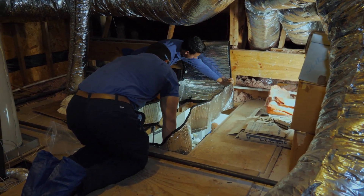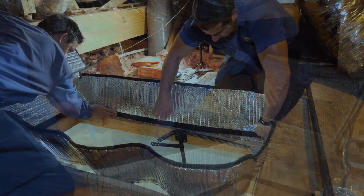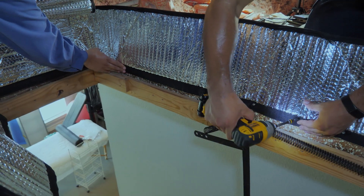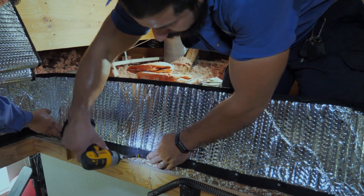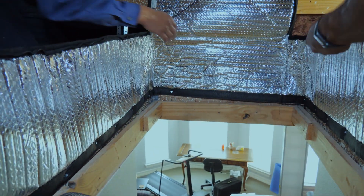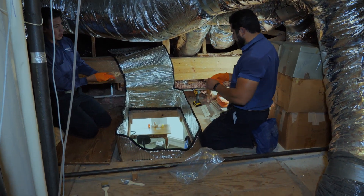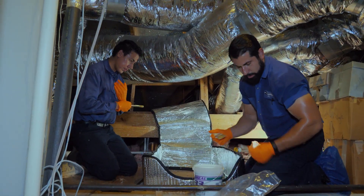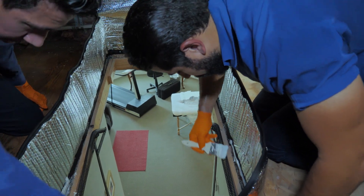Installation is basic and can be performed by one technician, usually within an hour. They'll use screws rather than staples or other fasteners for a more permanent fixture, fitting to the opening of the framing of the attic staircase. Once they're done screwing, they'll apply the sealant, using gloves and a paintbrush, with generous amounts of sealant on the whole opening.